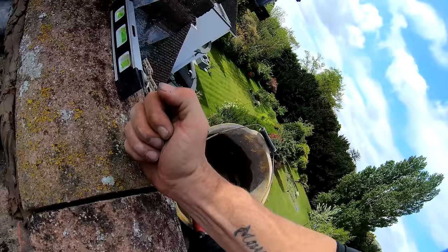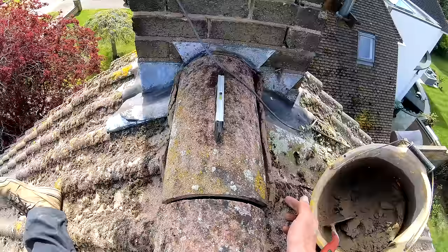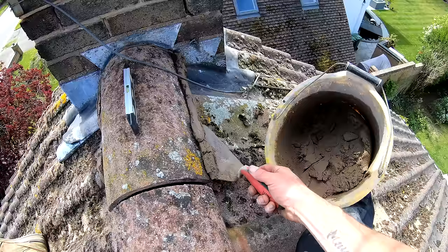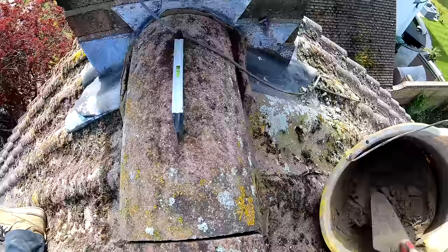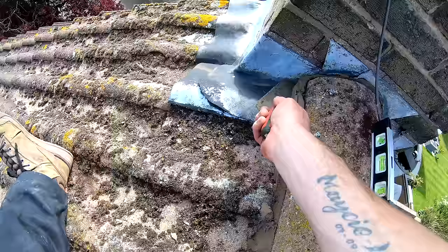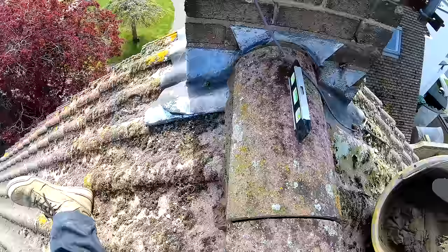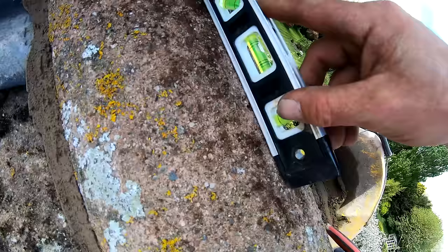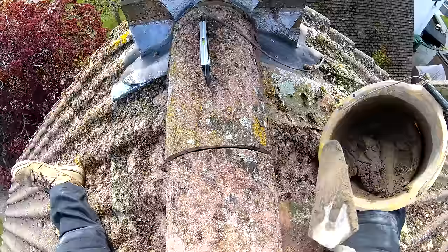Get your level, put that on top of the ridge and have a look. It needs to come down a bit — quite a bit this side as well. Tap it across, make sure she's straight. Clear a bit of the muck off the side. Just straighten this off here, a bit off here, a bit off there. There's a little bit more at the back there. Okay, we look like we're good to go — pretty close. Once you're happy with it, pointer up around the sides.